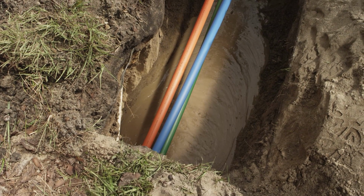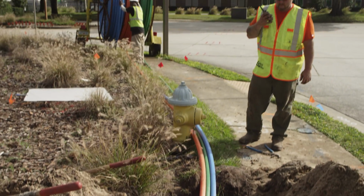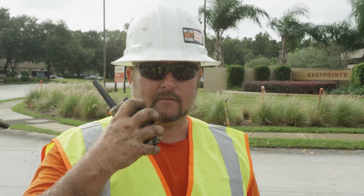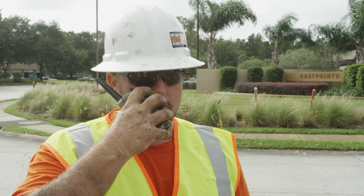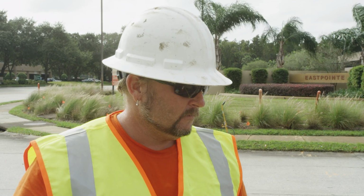At the exit pit, two-way communication must be maintained between the drill operator and tracker whenever the tracker is near the exit pit. If two-way communication is not maintained, the drill operator can receive an incorrect hand signal and begin drilling while the tracker is by the drill string. He or his clothing can be caught in the backreamer.